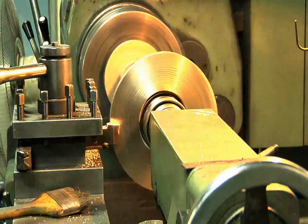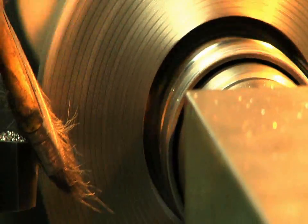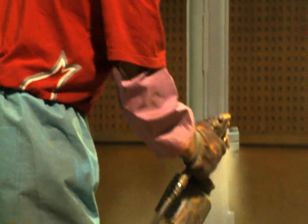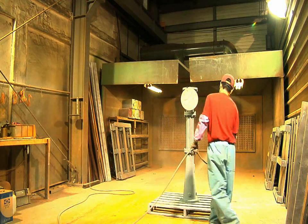And with the proper design of the duct, most of the energy in the mixing jet can be regained as static pressure on the discharge side. Because the eductors are extremely simple and robust, they are very suitable for a large range of marine applications.